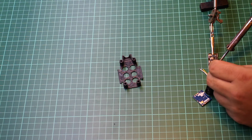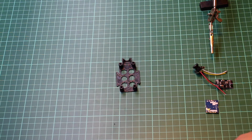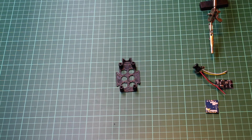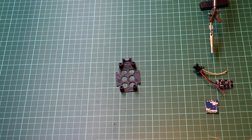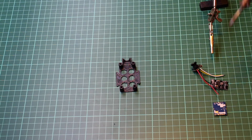Next was a case of wiring up the 5 volt side, so that was a lead from the positive and negative side of the 5 volt converter to the camera. I also tacked on another lead from that — again positive and negative — which will go to the transmitter. Lastly it was a case of reflowing the cables for the actual video signal to the transmitter.